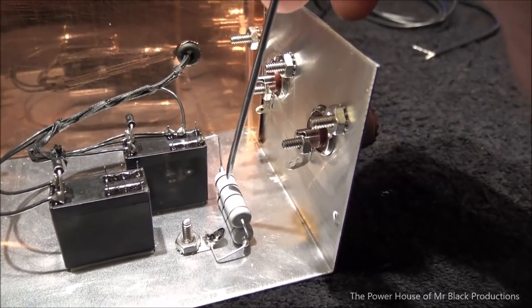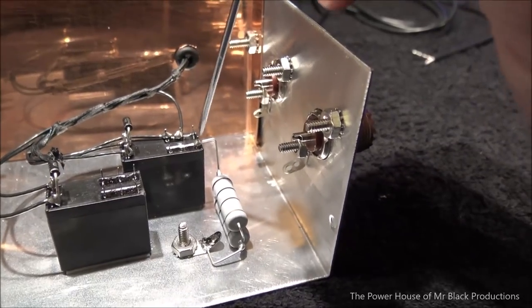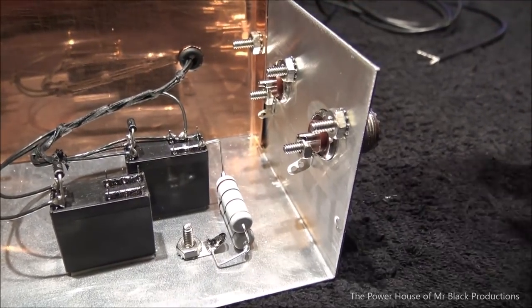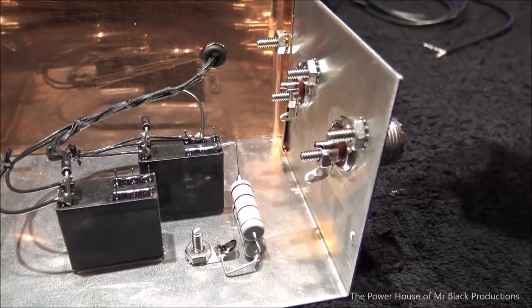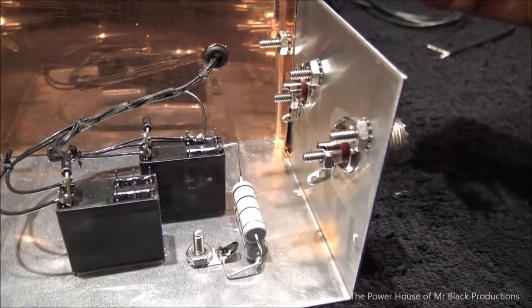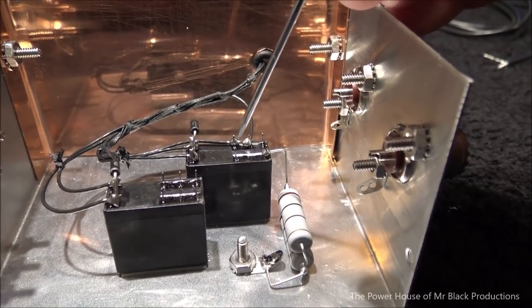So now he's gonna have a balanced load when he goes into transmit, so it won't fry his finals in his radio, just in case. Not necessarily necessary, but it could be. So I'm planning for the worst, praying for the best. So now, when we go into transmit,